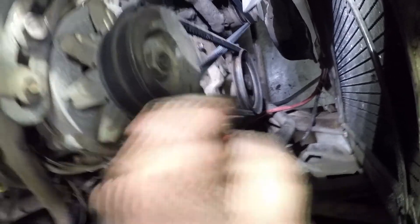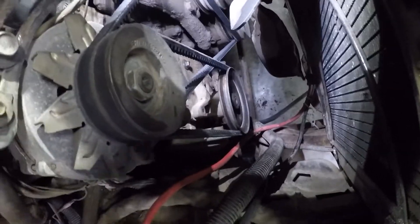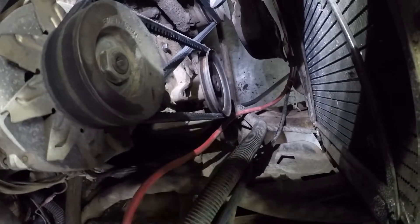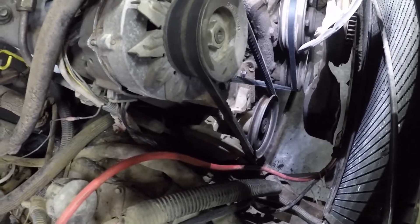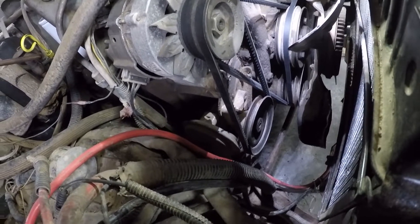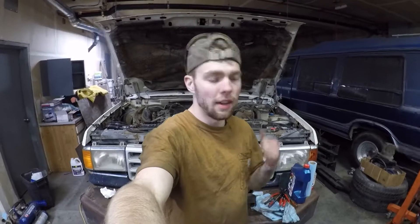Got a little bit of tension on that belt — not too much. Start it up and watch to see if it's flippity-floppity or squeaky. If it is, go a little tighter. You want to start out a little looser; it'll tighten over time with use. Otherwise you'll wear out or stretch the belt immediately. A new belt is going to stretch over time, so just watch it — if it gets squeaky or wiggly, you fix it. That's it for the vacuum pump. Make sure to hook your vacuum booster line up so your brakes are working. Don't forget to change your engine oil if you think there's diesel in it — even if you think your pump diaphragm didn't break, it's not worth ruining your engine. The unit's running pretty good, so we're ready to move on to the next battle: maybe a full return line kit or an upgraded starter. I'll see you all in the next video.